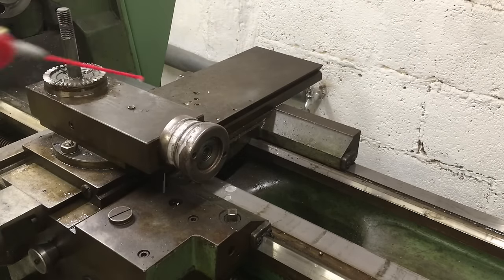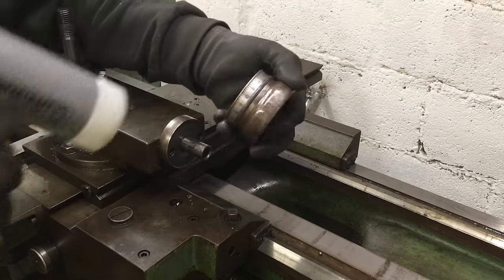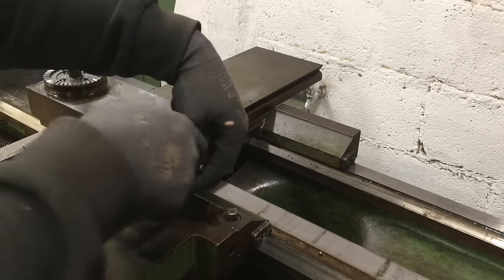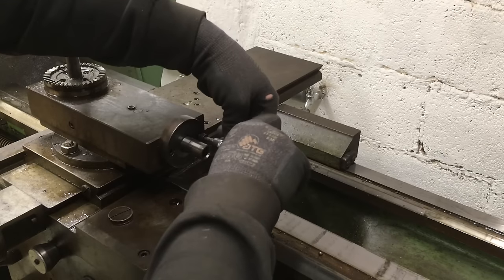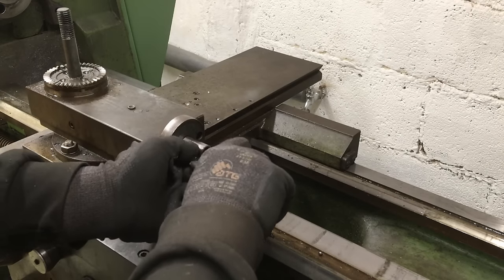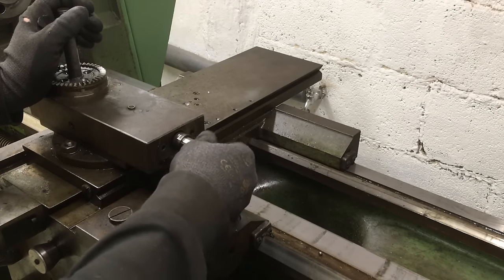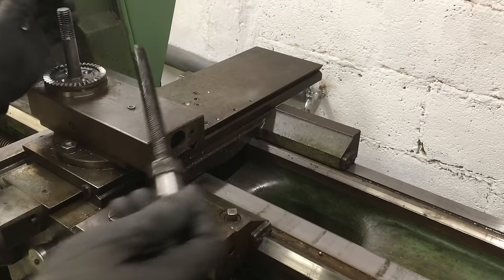The handwheel was also stuck, so I am very carefully hitting it with a hammer while trying to give it a bit of support so the lead screw doesn't bend. I can definitely tell the compound was used the most when unscrewing the lead screw. That is not terrible or anything, but a new lead screw and nut would make for a good project one day.